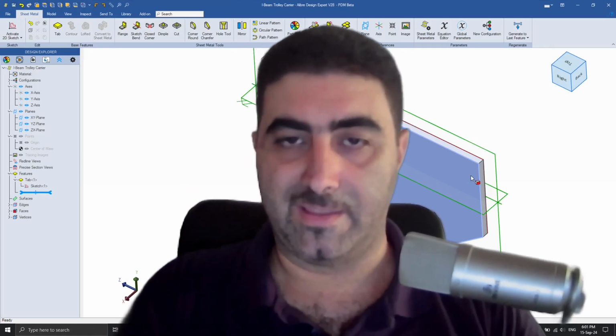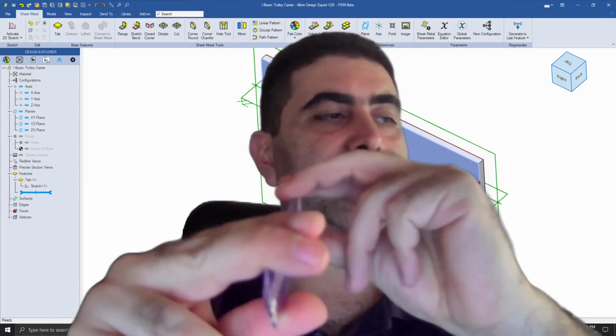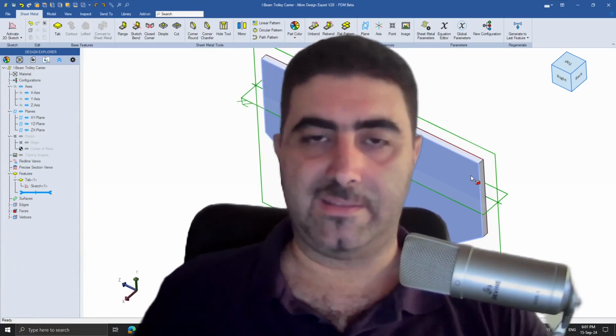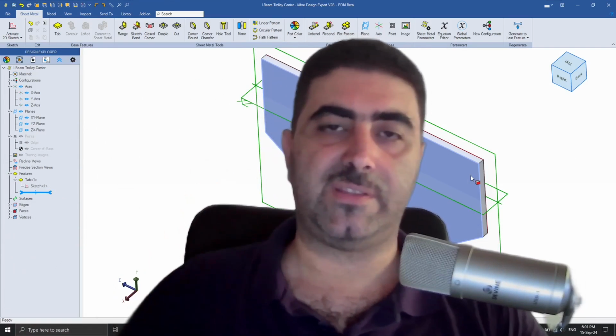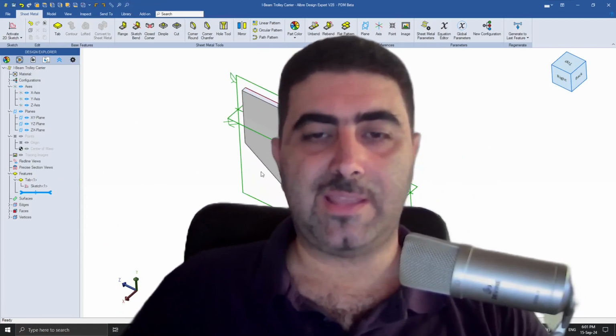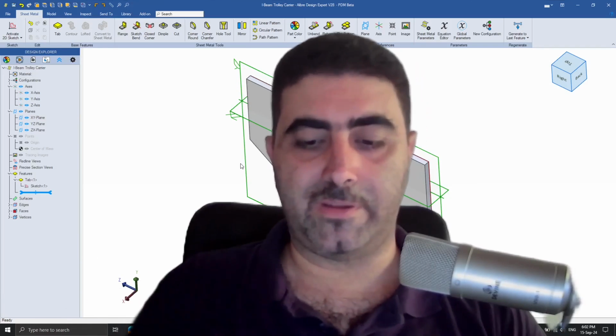So that's the whole thing. That's why you can bend the ruler very easily this way, but you cannot bend it this way. It's because as soon as you rotate that section, you get a different moment of inertia. That's the high-level explanation of it. So what has that got to do with our part here? Let's jump back in and I'll tell you.